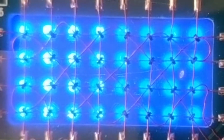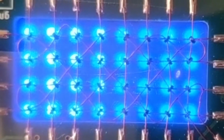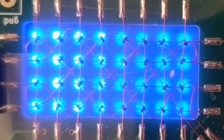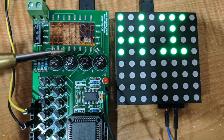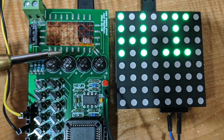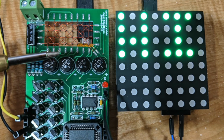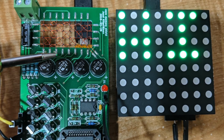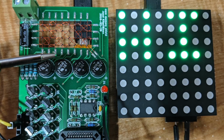But I wanted to go further with the shield and make it actually do something. Since each core represents a single bit, I thought it would be interesting to visualize the state of each core with an LED, and that led to my first proof of concept. I put together this proof of concept using a serial link between Juicy's 4x8 core array and a RainbowDuino LED array. It worked and was surprisingly fun to use. I effectively stumbled on a low-res touchscreen overlay.